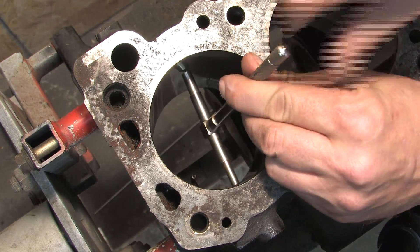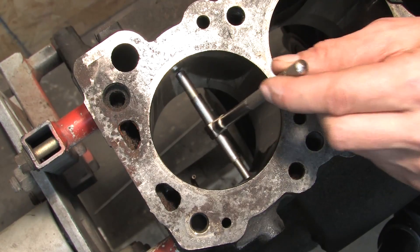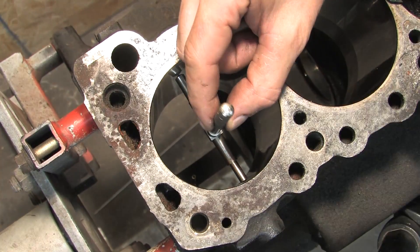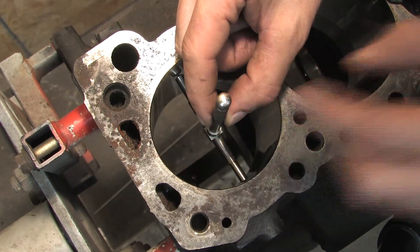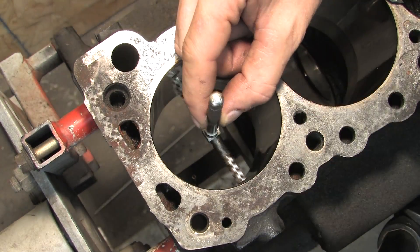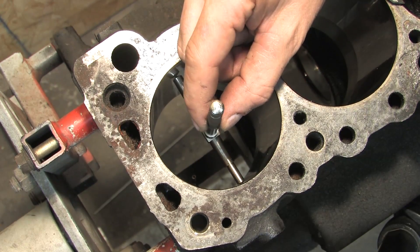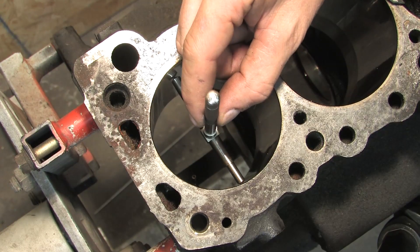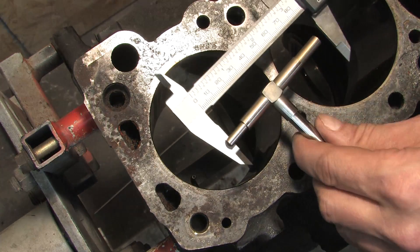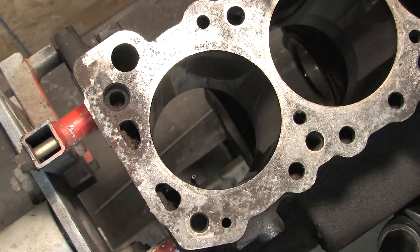Here we are close up at only 2x — it's easier to see how this works at this speed. Notice the handle slides around on the probes; pay attention to that while you center the tool inside the bore. Gradually tighten the lock while feeling around with the probes. It should be a little bit difficult to rock the gauge back and forth no matter where you are, off-centered from where you measured. If you can't rock it, it's too big. If you don't feel any drag, start over. You want it to feel like it's almost binding while you wiggle it around. Once you've got it just right, measure your result and try again to make sure you get the same thing.